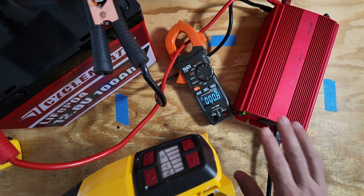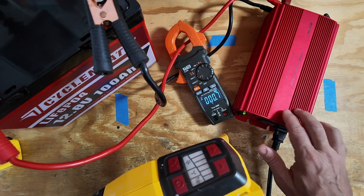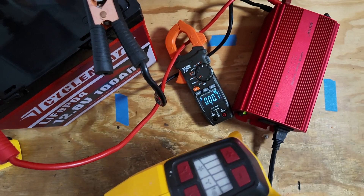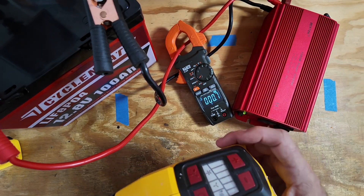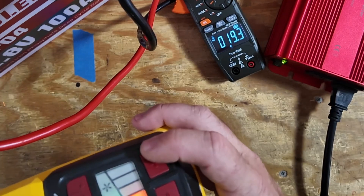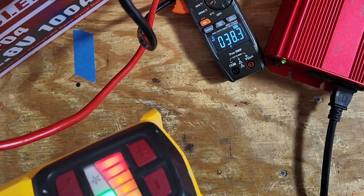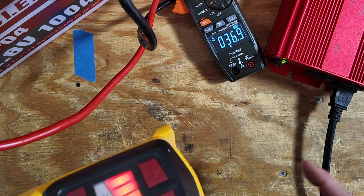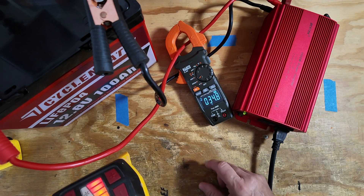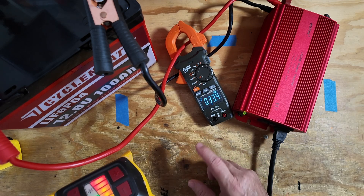I want to run a couple of tests here. I've got a 1,000 watt power inverter — that's the biggest one I have — so we're not going to be able to test the over discharge protection, but we can see what we can run with it. With the heat gun turned on we're drawing right around 20 amps; cranking up the heat gets it up to between 38 and 40 amps. That would be more than enough power to run two digital stations at 100 watts on field day. I did try a couple more power tools, but unfortunately through no fault of the battery, my inverter just wasn't enough to test any more power tools.